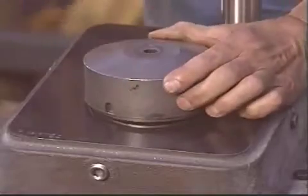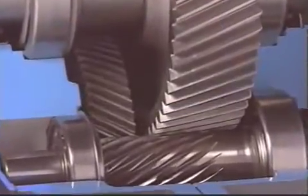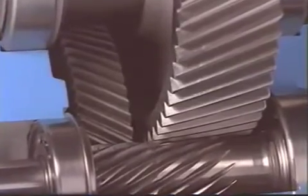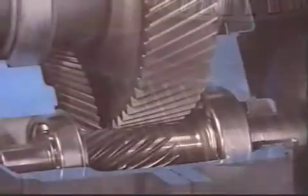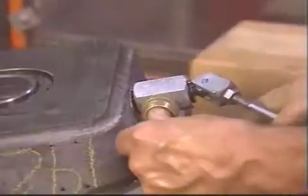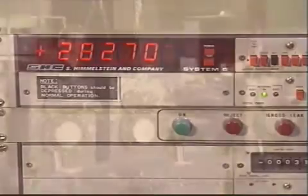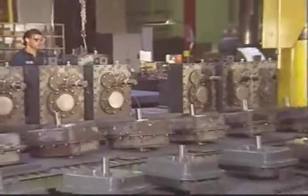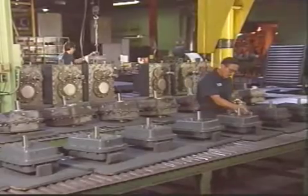The low-speed shaft is capped to protect the hollow bore. Falk quad-drive high-hardness, surface-finished helical gears have larger teeth and a wider face, provide a minimum 120% strength rating, and are held in alignment by rigid, accurately cast or fabricated housings. Assembled and tested to rigorous process control standards, Falk's new quad-drives are volume manufactured to optimize both production economy and performance satisfaction.